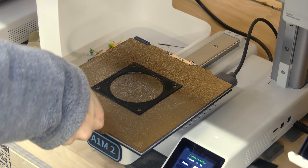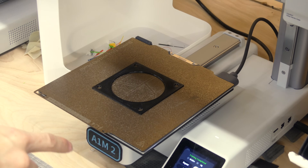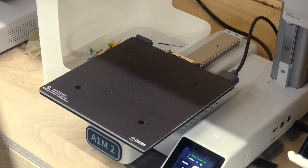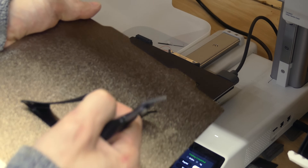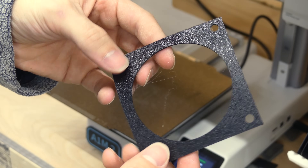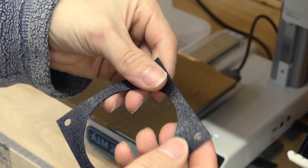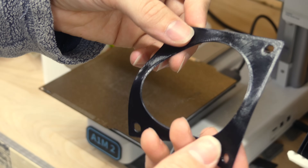Our TPU print just finished up. One thing I remember about TPU is if you let it sit on the build plate and cool down too much, it does not want to come off. So I'm going to try and get this off the best I can — bending it probably does no good. Let's just get underneath it. Now we've got our little TPU gasket. I'll probably put the textured PEI side against the plastic part since it gives a smooth textured finish and isn't as rubber-like as the other side.